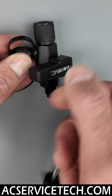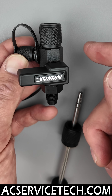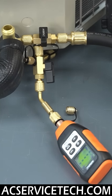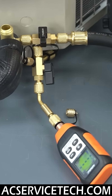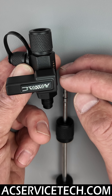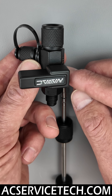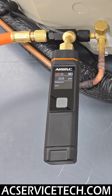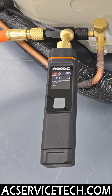You want to have a good vacuum-rated ball valve on your VCRT for pulling a vacuum. You can just valve this off and keep your vacuum gauge right here on the side. This ball valve is rated down below 20 microns, which is a pretty deep vacuum level. You can also use this for doing a recovery process and connect your pressure probe right here on the side to monitor your pressure.